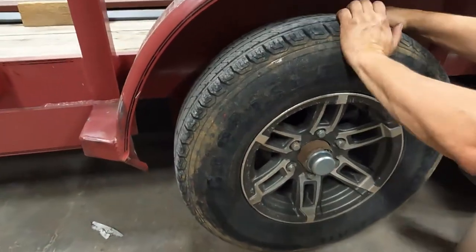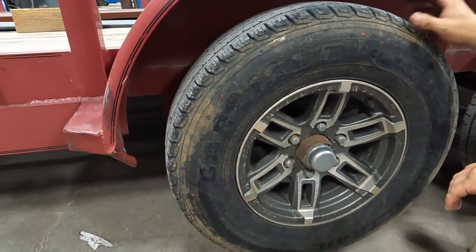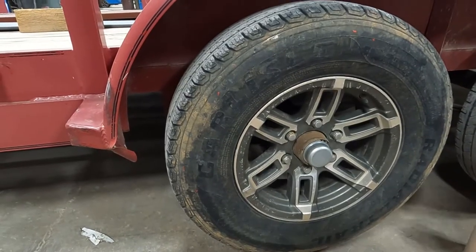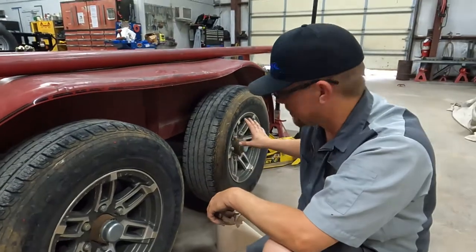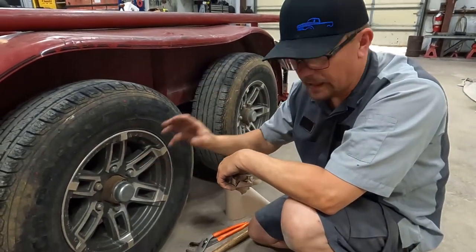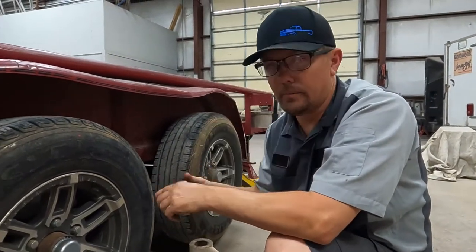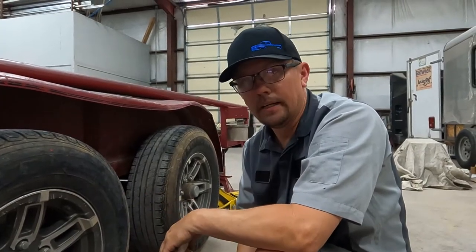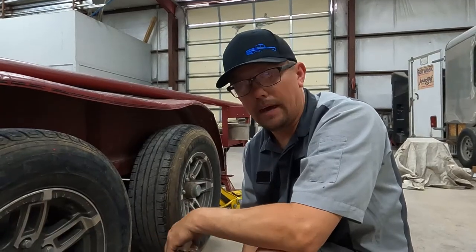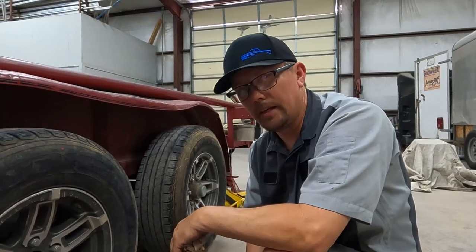All right, it's installed. Now I don't see any movement — I can feel just a minimal amount of slack in there, which is what the manufacturer recommends. That didn't take but a few minutes to do. Like I said, this other one is going to take some more work, but this adjustment will make your bearings last longer, keep them from overheating, and potentially keep you from losing a wheel and hub when you're headed out on that trip. Stay tuned for more videos. Remember to check the links at the end of the video for the tools we've used. Give us a thumbs up, subscribe if you haven't, and if you have any comments, please share those with us. Y'all have a good day.